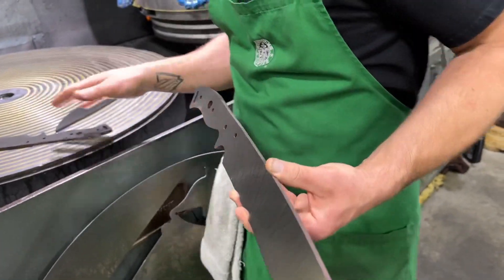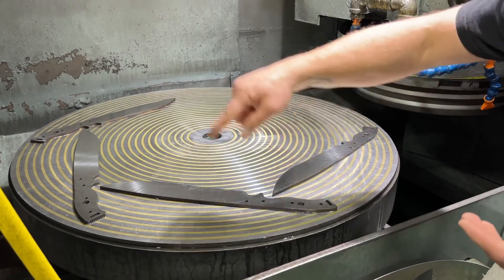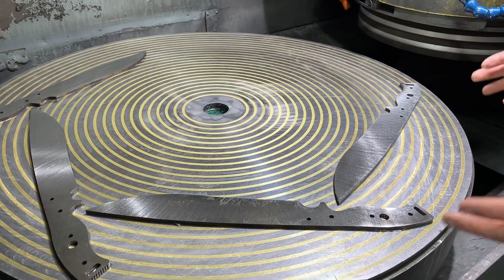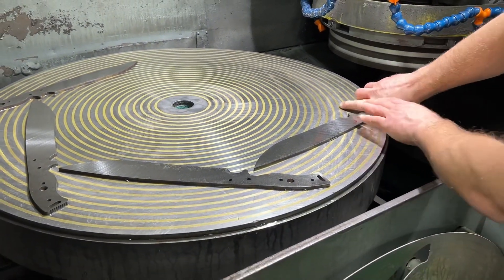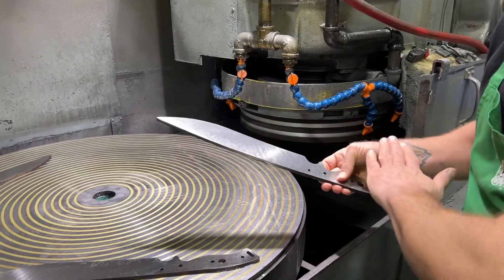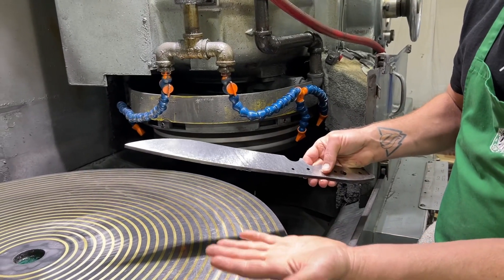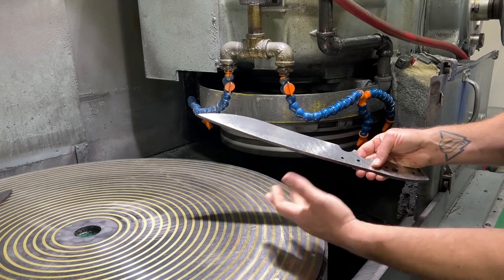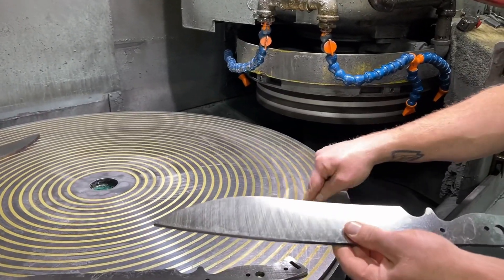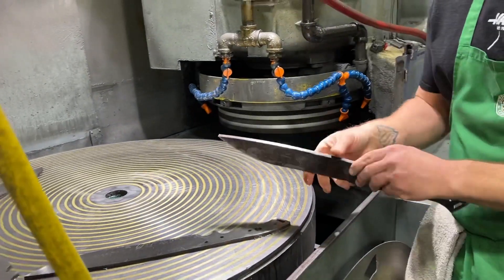Something else I wanted to point out — I say these are more time-consuming and it really is true in every regard. We only get six per table load here, and with smaller parts I can usually scoop up the whole table, blow them off, and they're pretty well done. These are so big that I can only take one off at a time and I've got to blow and wipe them off one at a time, get them stacked, and wipe the table down. Any lint, dust, or debris of any significance will affect how this face mounts to this face, so we want all surfaces flat and parallel so our grinds come out good and we have a uniform edge tolerance.